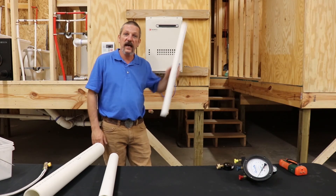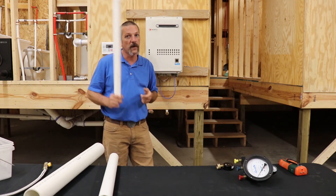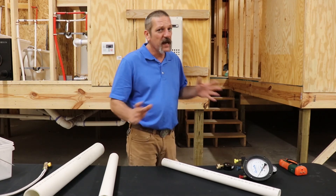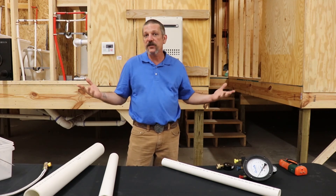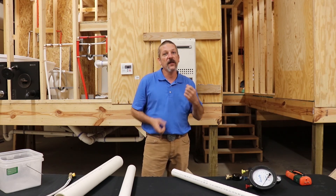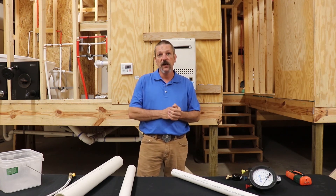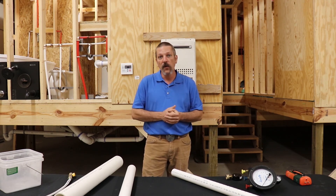So if you wanted to figure out how much PSI a water tower generates and you knew how tall it is, every 28 inches is one PSI. I hope that gets you somewhere; I hope I explained that well enough. If you've got any questions, you can ask me — I'll be around. Thanks for watching the video. I hope you learned something. Just remember, it's a lifetime of learning, so always be out there trying to gobble up any little pieces of information. You can figure out ways to apply that to your job, your career, and we'll all go a long way together. Thanks a lot.